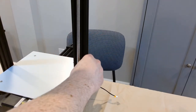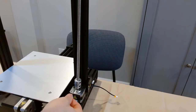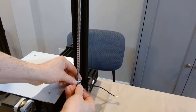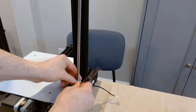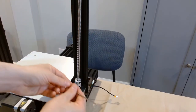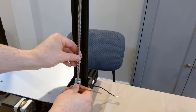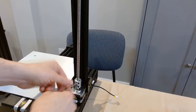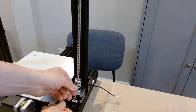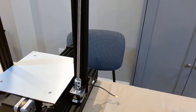I put the coupler on top of the motor and made sure that the axle sticking up was under the middle lip. I tightened it up very nice and snug, and now it's time to put the lead screw in. I place it in and unscrew the top part of the coupler in order for this screw to bottom out completely — and it does, to that middle lip — then I tighten it back up. Now these are screwing into themselves, a coupler screwing into itself, so you can tighten these up pretty good. No need to muscle and bind it down, but you want them nice and tight — you don't want this going anywhere.